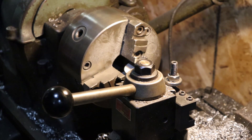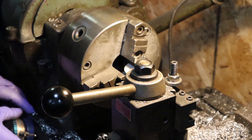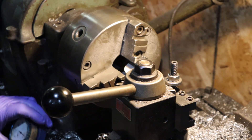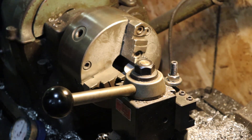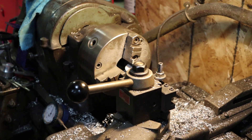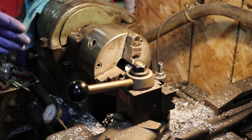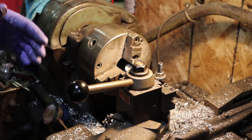What we need to do is set up a dial indicator. You guys aren't going to be able to see this because the dial indicator is on the floor, but we're going to set it up on the carriage because this particular lathe doesn't have one built in. We're going to watch this dial indicator. We need to take a quarter of an inch off of each side, so we'll do a total of 250 thousandths — probably 50 thou at a time, making five cuts on this particular side.